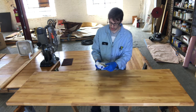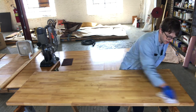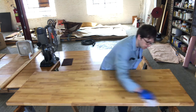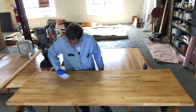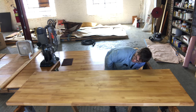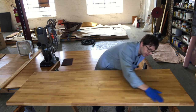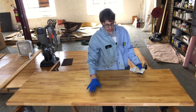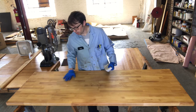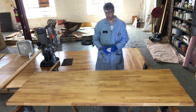We're picking up all the slurry we made with the mineral spirits. Because we made a wet slurry, you don't kick up a lot of dust, but if you sanded dry, definitely vacuum up residual dust. Once dried off, everything should look pretty even. Run your hand across it — you shouldn't feel any major imperfections, though open grain or wood character may leave a few things. Overall you should have a pretty smooth surface both visually and by feel.